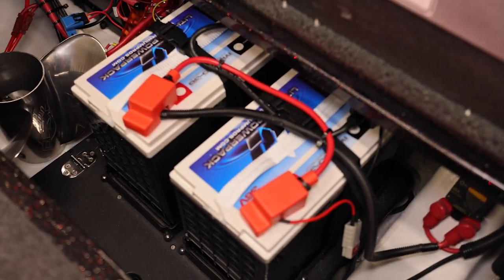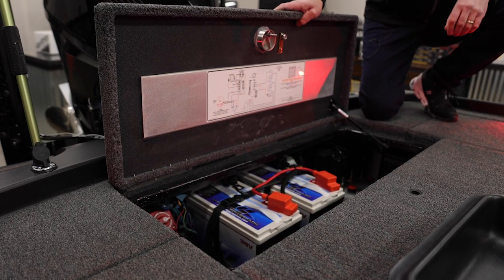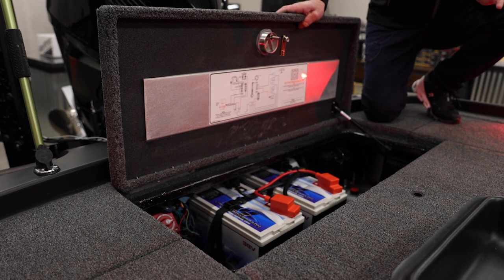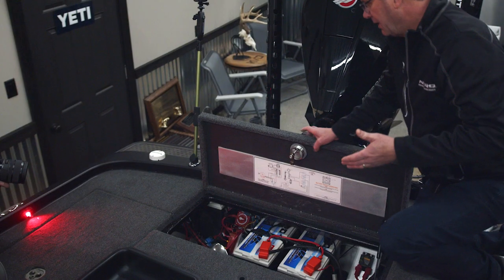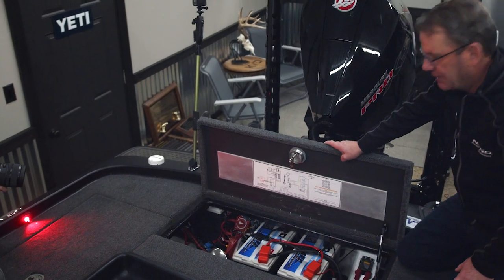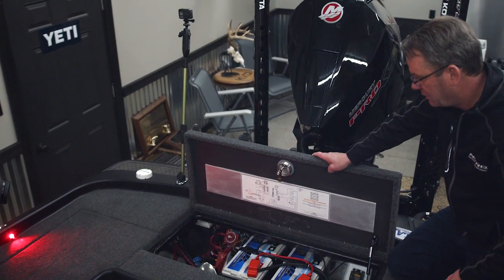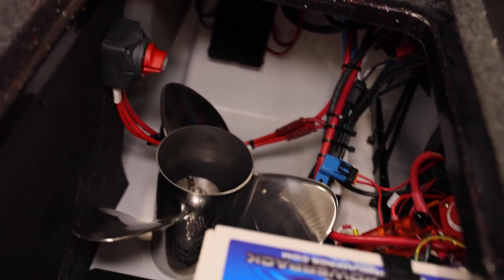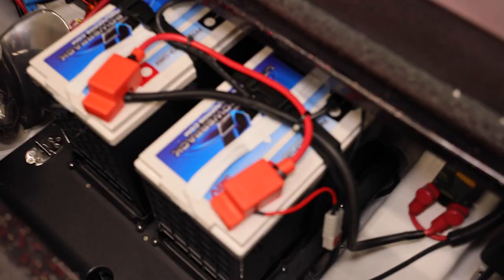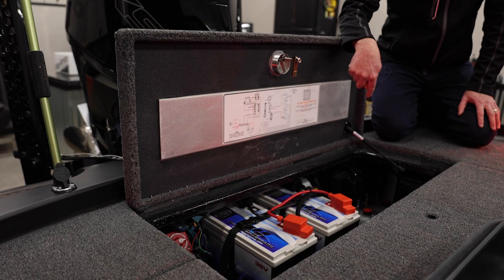And I'm running 3 Lithium Pros batteries total for my power system. These 3 batteries are equivalent to 6 31 series standard lead acid batteries. So I've got a ton of power, even with all the electronics and extras that I have to manage that. So for my crank battery, again, it's a 215 amp hour battery. It's basically the equivalent of 3 31 series. It's mounted underneath over to the side, and I have a dedicated power switch just for my electronics. I have one for my engine, and then I have one also for the 36 volt side for the Ultrex